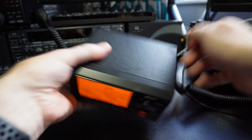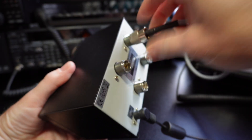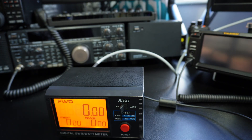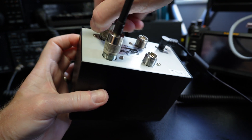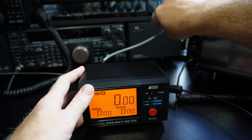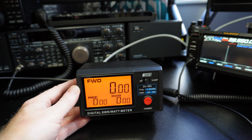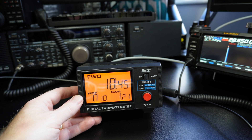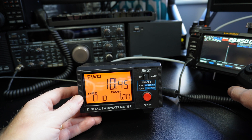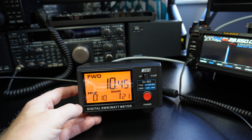Let's get connected up. On the rear we're going to go straight from the DX10 into the TX of the SWR meter and then straight out to a dummy load. I'll put the DX10 on at 28.550 FM — I think I'm just about at 10 watts here. Let's have a look. Yeah, it was on 10 watts. So 10 watts on the DX10 into a dummy load — it's showing 10.45, so that's near enough, isn't it? Nice to see the reflected power there as well.